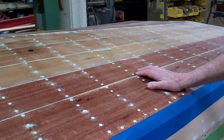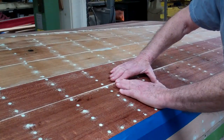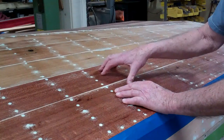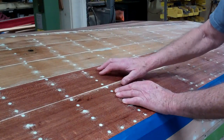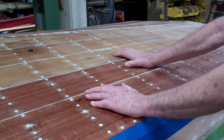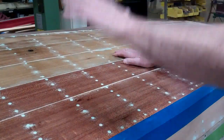And in that connection, you've heard us lecture and lecture against trying to caulk seams with 5200 because it gets super hard, will not compress any longer, and leads to cupping and breaking and destruction of the planks on either side. It also fails, and I don't know how many videos we've shared with you where one of us is just pulling strings of this stuff out. Why not here? Well, here we have a monolith. Remember, the underside was completely buttered, and in our case, that layer is 1/8 inch thick before everything gets screwed down.